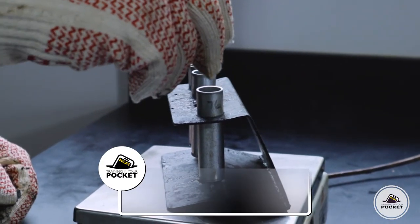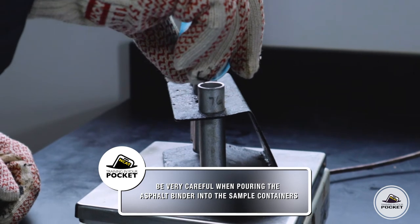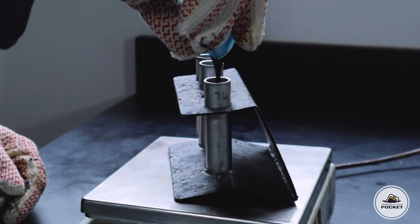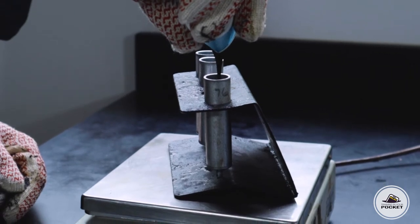We need to be very careful when we're pouring the asphalt binder into the sample containers, because we don't want to get any of the asphalt binder on the sides or on the top — we need it all in the chamber. So it takes a steady hand. It does.